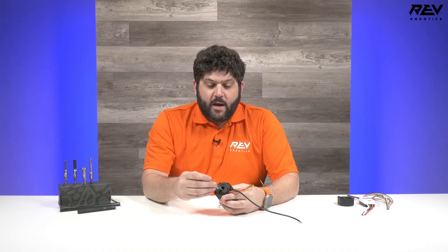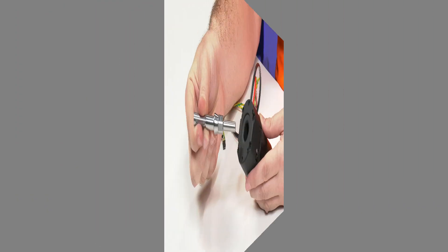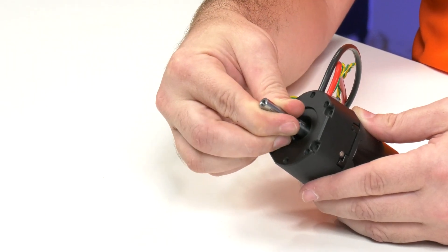While that's great and flexible, for some applications you need a higher degree of precision, as a hex shaft will have a little bit of backlash. So what we've done is we've added a taper functionality to the front of the motor. Our custom shafts made for high precision applications feature the half inch hex to do the actual torque drive, but also this taper section so this self-centers. This is very similar to what they use on a milling machine, and the taper will directly center it. Then you'll use one of our shaft retention screws on the back side to draw that taper in, giving you an incredible connection that is also very self-centered and just as precise as if the shaft was integrated into the motor full time.